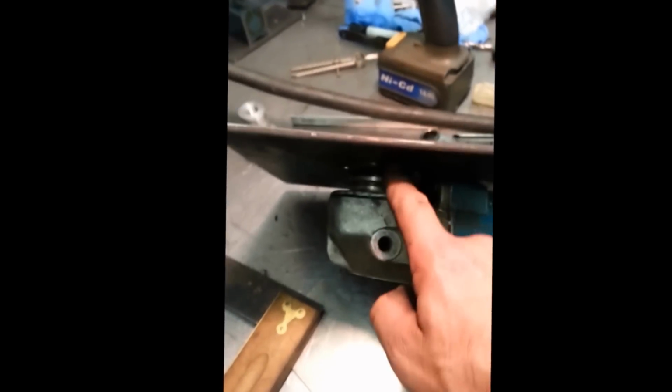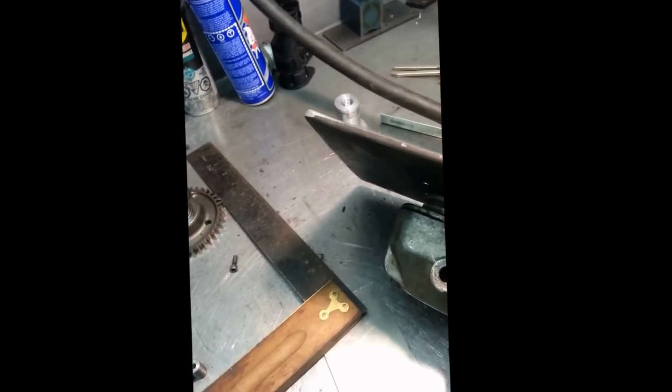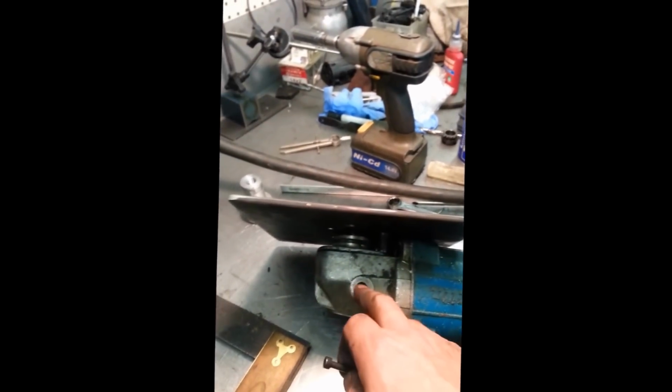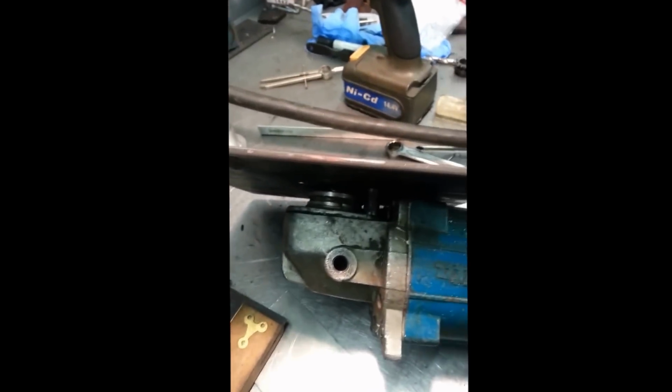And then I'm going to build an L bracket off of the main handle support that normally be here, because I think if you're only supporting off these 4 small 4mm bolts, you probably shear that plate off if you ever get a jam. And I think you need that big 3/8 bolt that's there to support both plates. Right?